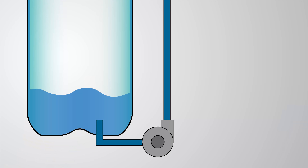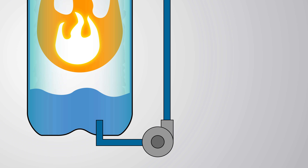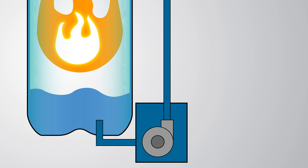Clearly the issue is that whenever combustion starts in the chamber, the pressure travels down the tubes to the pump, where the pressure differential between the combustion pressure and atmospheric pressure is so great that the pump just explodes. An easy solution is to build a container around the pump, so that whenever it fills with fuel and is pressurized, the pressure differential across the pump is almost nothing, and all of the pressure differential between combustion and atmospheric pressure is held by that container. So I went to the store and grabbed some PVC parts just big enough to fit the pump.